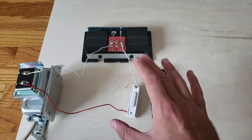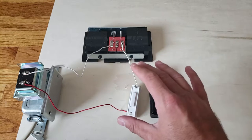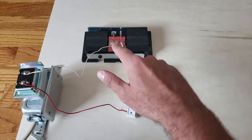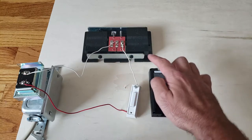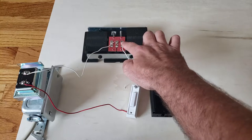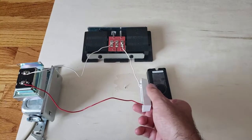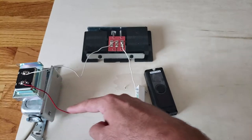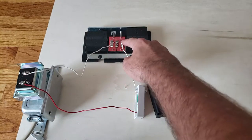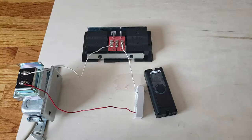This wiring diagram shows the exact same setup as doorbell wires in your house. You've got a doorbell wire that goes from your doorbell transformer to the trans terminal on your doorbell chime, then a wire from the front terminal on the doorbell chime to your doorbell button, and then from the button back to the transformer — a full circuit.